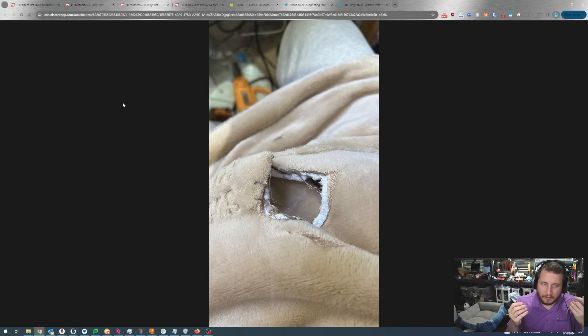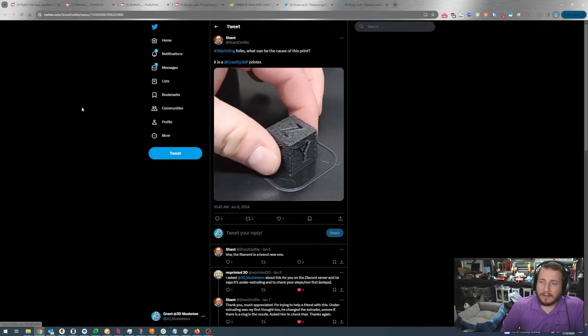At the same time, you need to be careful — if it can melt fabric, it can also cause damage to other nearby things. Make sure your PTC heaters are not near anything flammable. Most clothing is not flammable assuming it doesn't have rayon in it. Man in the Sky is lucky. Please be careful — it wasn't skin, imagine if your skin touched that. The best solution: unplug it, remove the power cord, and put the cord somewhere away from the printer.